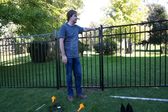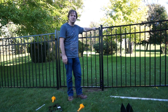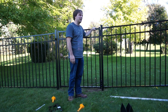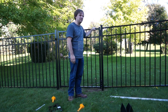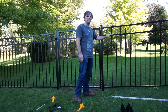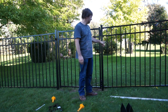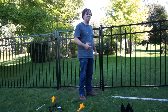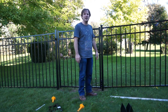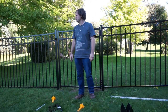It went in pretty quick and didn't take a lot of labor. It took about three weeks, mostly working three or four hours on weekend days. I did the post pounding pretty quickly, then wrapped up most of the rest. There are some fit and finish issues — most of the panels I bought were pre-assembled. If you buy more than four, they can send you a pallet of pre-assembled panels, but a lot of them had the screws stripped out and they were actually falling out of the panel. Once you strip out that aluminum, you really can't come back from it because it's so thin.